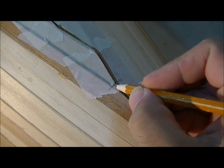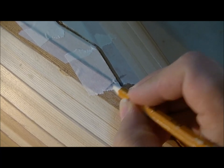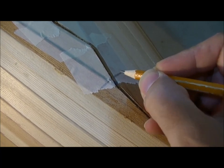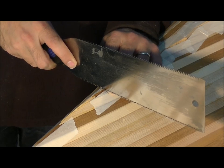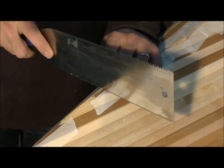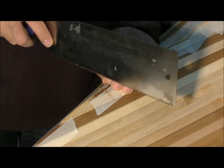Using a pencil, we need to mark where the outer stem is going to terminate within the hull. You're going to need to cut into the hull so that the stem pieces fit in within the same thickness as your cedar strips.